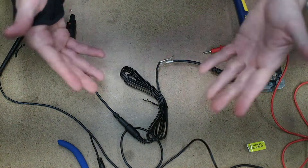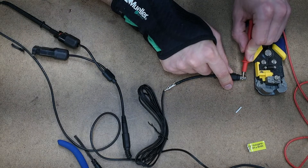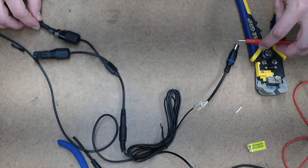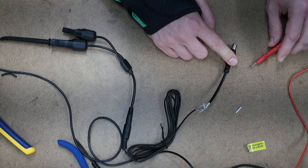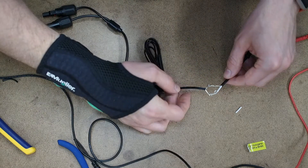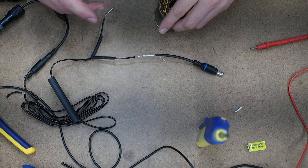Now I have my cable all marked. I'm going to stick this probe into the positive of the MC4. Right now it's going to the ring, so I need to swap these two wires. Now that should not make a noise — okay, so we figured it out. Now to solder this up. The white goes to the non-dashed line. It's important to put your heat shrink tubing on before you solder — I've forgotten that once or twice in my life.